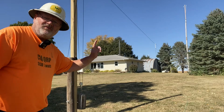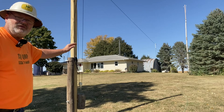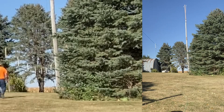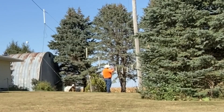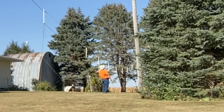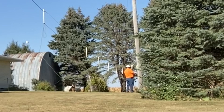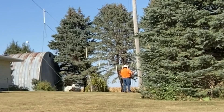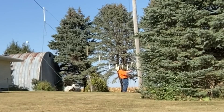I'm going to walk up there and show you how this counterweight mechanism works when I raise the wire. You're probably wondering about the pith helmet. Well, out here with the wire up and down the pulley at the top of the pole, there's always a possibility that the eye bolt up there could break and snap off. Next thing I know I've got a steel pulley coming straight down on my head, and I really don't want that. So I take a little safety precaution and wear a hard hat out here just in case.